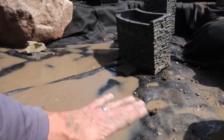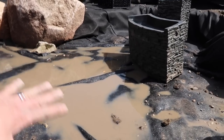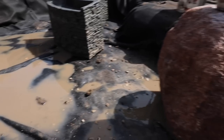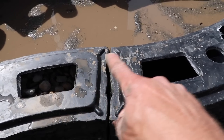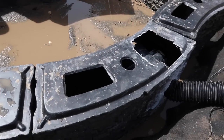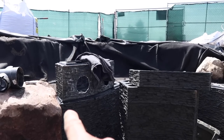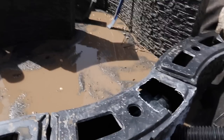People are going to be walking on top of this, so the idea was this whole bottom is basically going to be a flagstone patio, so it's all going to be big pieces of slate down here. Our elevations work out as such to where we can just bring the slate right over the top of these, and we will cut the front of them to almost make it look like a coping. So the slate's going to overhang these walls, and then we will do the same to mimic that along this tall wall back in through here. So that is what the finished product will look like.